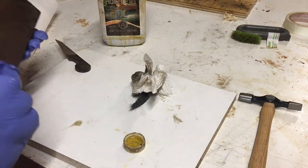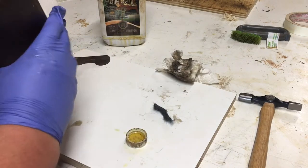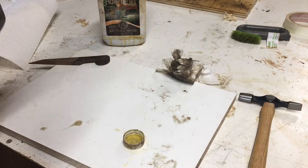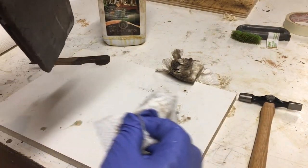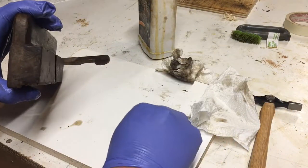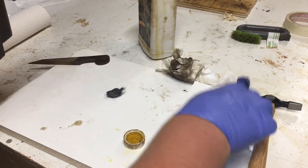You can see that old color start to come back. I take some steel wool and wipe the top, the chamfers — same thing. Then to get the ends, I do the same, clean that off really well. Sometimes you have to scrub a bit harder to get any of the marks showing up, but once you do they show up quite well. Then I'll get the back as well, making sure I get all the chamfers and nooks and crannies clean.